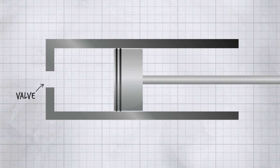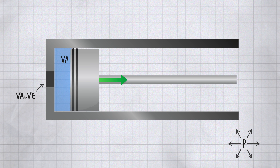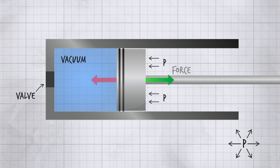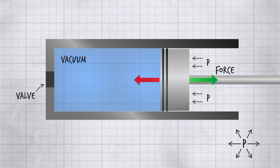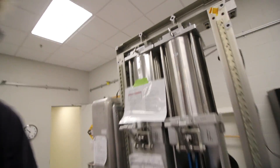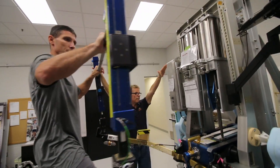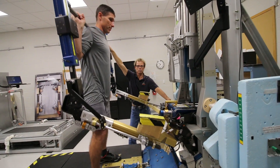Think about it. You've got a cylinder, a piston, and the atmospheric pressure all around. If you push the piston in all the way, close the valve, and pull, you're going to create a vacuum. Because the normal air pressure on the inside of the station is pushing on the backside of the piston, it creates a force — more importantly, a constant force. This is super simple and super clever. So as the vacuum pulls the pistons up, it forces this arm down. Pistons go up, arm goes down, and that's constant. Right now the vacuum is holding this arm to the upper stop. When Mike stands up, it will release.